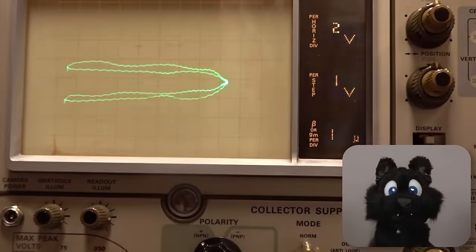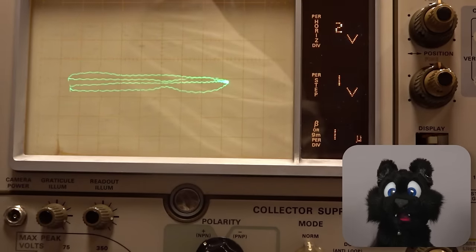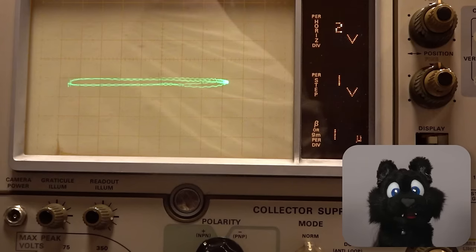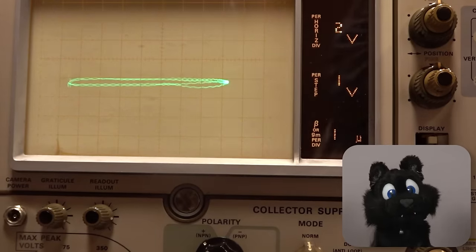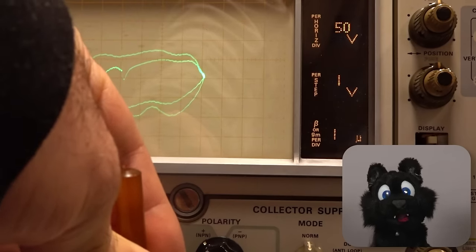And for the final steps, we are looking at the looping compensation settings. The goal would be to have a straight line. But at 1 microamp per division vertically, that is almost impossible. So getting as close to it as possible should be good enough.